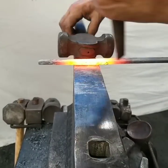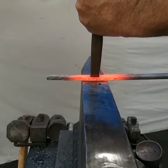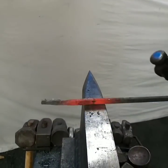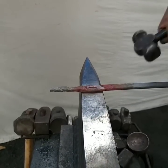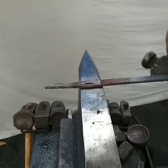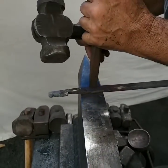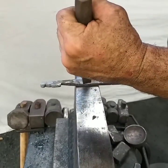Okay. So I feel fine. Look after every hit. Turn it over, hit with my round surface, just that area, to get it down. Then I reestablish my mark, turn it around, turn it over, and I place the light mark off a little bit, so straighten it up, another light mark, that's pretty good.